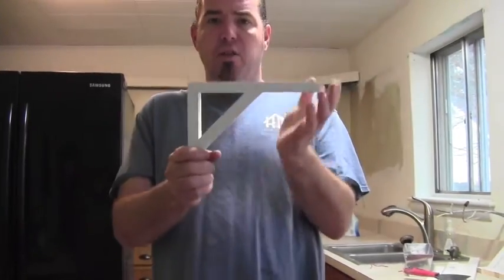We got all the cabinets ripped down yesterday, covering up all holes and making it nice and pretty. Now what's cool about these shelves is it didn't cost very much to make. What you see is about $150. We'll be using little corner shelf supports to support these. There's a couple different styles at the box stores — some look kind of country, and some hobby stores have ones but they're really expensive, like up to $12, $15 a piece. I just took some 1x2s to support the shelf. Super sturdy and I made 23 of them for about 20 bucks. I'm going to show you how to do that.